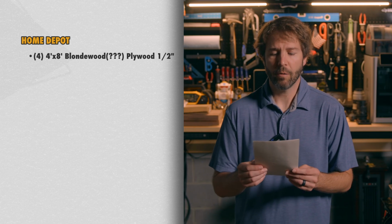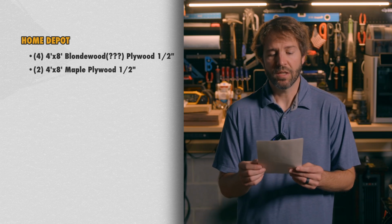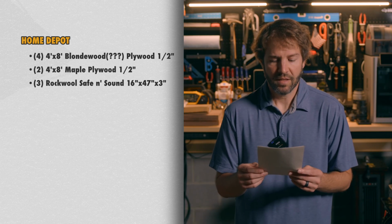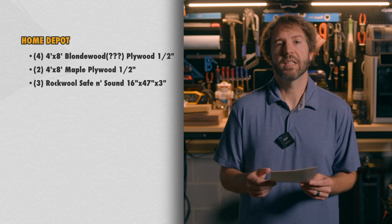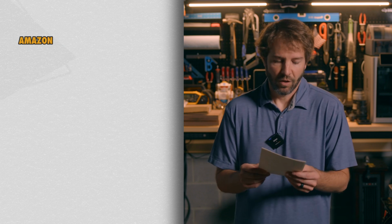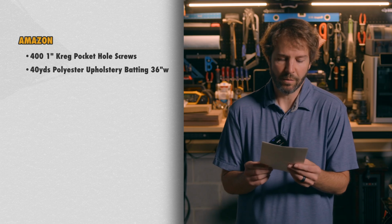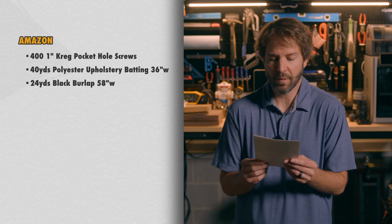If you look down below in the description of this video, you will find the materials used. Home Depot: 4 sheets of 4x8 plywood, Blondewood, 1/2 inch thick. 2 sheets of 4x8 maple plywood, 1/2 inch thick. Rockwool Safe and Sound, 16 inch by 47 inch, 3 inches thick, 3 bags of it. Amazon: 400 1-inch Kreg pocket hole screws, 40 yards polyester upholstery batting, 36 inches wide, 24 yards black burlap, 58 inches wide,